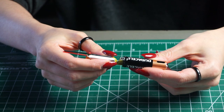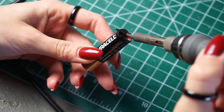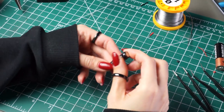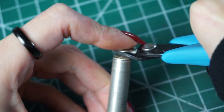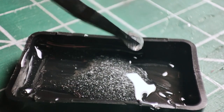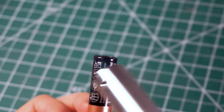Carefully stuff all the electronics inside. I hope nothing broke off in the process — it's not easy with such a small hole. It seems to have worked out. The plus from the battery needs to be soldered to the iron case. As you remember, we made a hole in the back of the battery, so we need a donor. For the sake of the back cover, I dismantled an old G8 battery to get the part without damage. I soldered the wires from the battery to this cover. When installing, the main thing is not to short circuit — the back cover must not touch the case. So I use epoxy glue, which doesn't conduct electricity, and carefully glue it all together. In the end, I give the thermal film its original appearance. As new! Reworking shows only the USB connector and the LED holes.